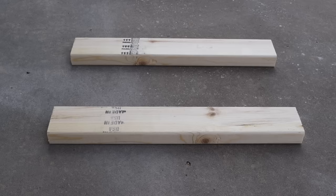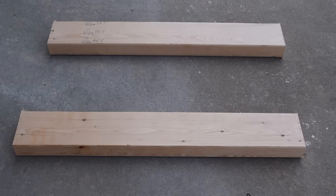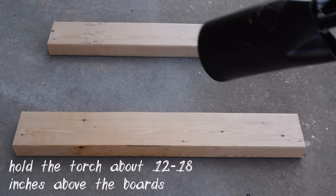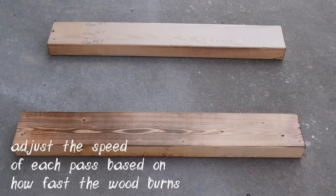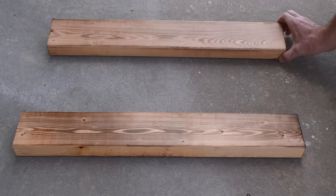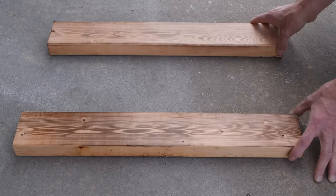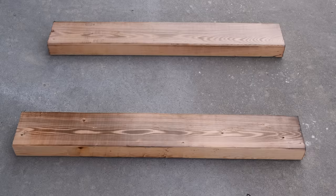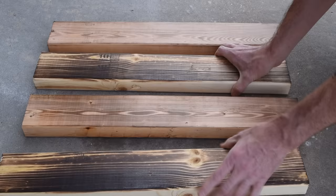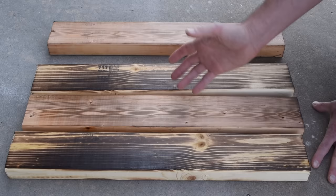I'm going to show you these two boards with the straighter grain first, and then we'll hit the two boards with the tighter grain. As you can see, I didn't char it very much — I did it more just to show off the difference in the grain. This one reacted a little bit differently than the other one. It's important to test out a couple of pieces, because the first two I did were a little drier and they charred very quickly, while these took a couple of passes. Already you can see the difference in the grain pattern, and in my opinion, this looks way better than that.